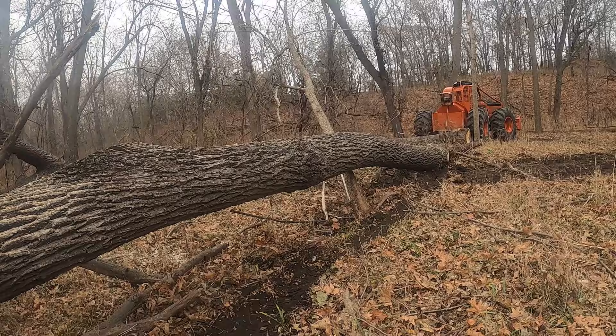Today I'm gonna be showing you how to cut off a tree that's got a lot of pressure up in her — she's busting down here, got cracks in her. But I'm gonna show you a way to cut this off without using any type of wedges or anything, and how to cut in. Like I always tell you, watch your saw gap and keep your saw gap cut back open, and you can cut straight down through this even though it's got lots of pressure on it and make a clean cut off without getting pinched.